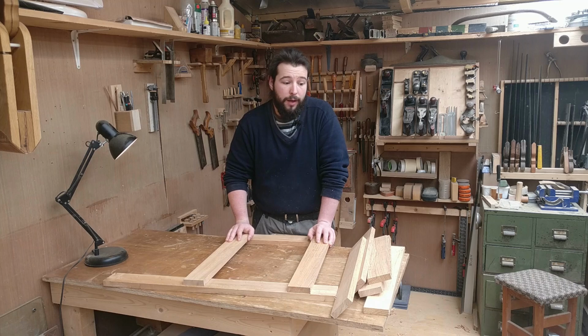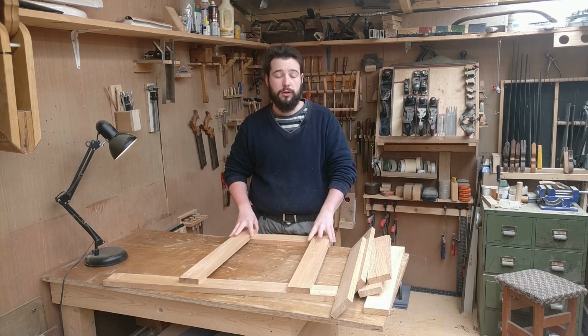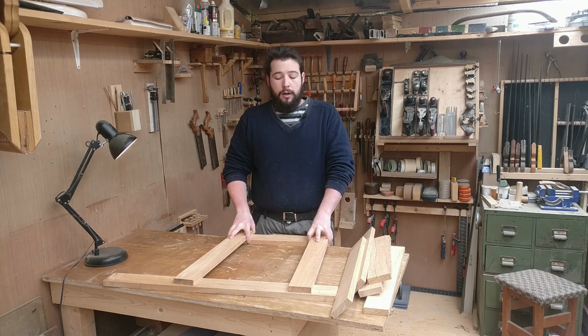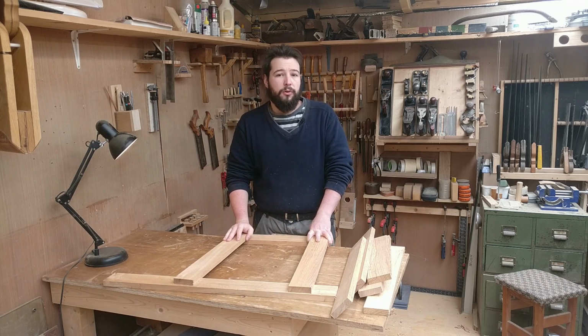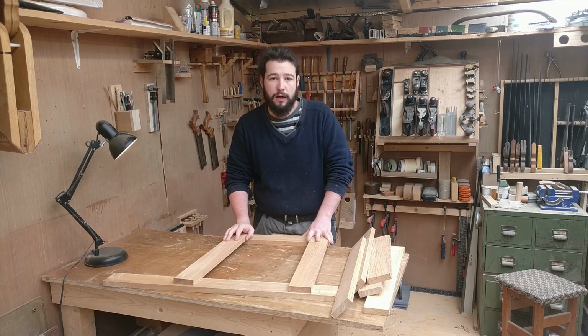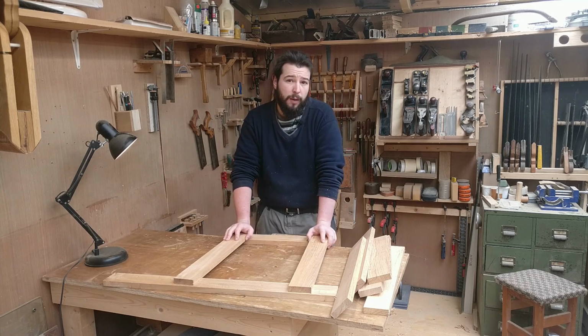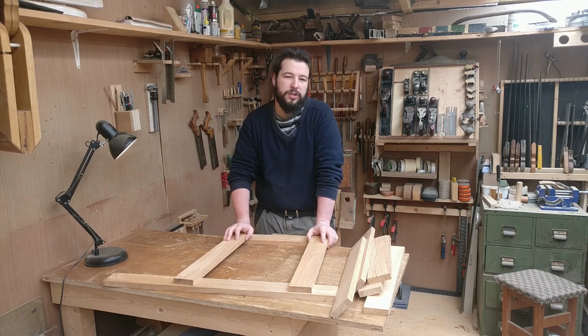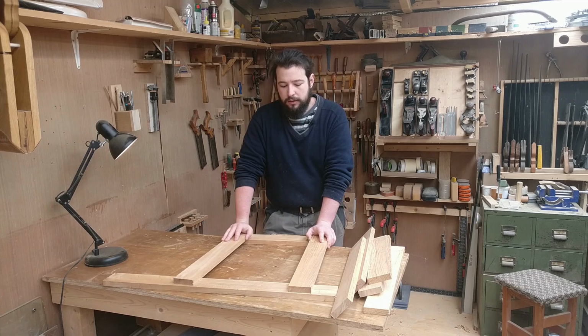Or else I'll just have a really big problem and I'll look like a fool. And then for the lid, I'm going to glue in an entire panel of 1/4 inch ply. I want to have areas for storing saws on the bottom of my lid, but that is loads and loads of space as it is there. So gluing in a 1/4 inch panel of plywood, something like that, will add a massive amount of strength to the top. It'll prevent it from bending and breaking. So I can put stuff on top of the lid, which defeats the purpose of a lid, but I think is important to have just in case. Yeah. So that's the story of my joinery.